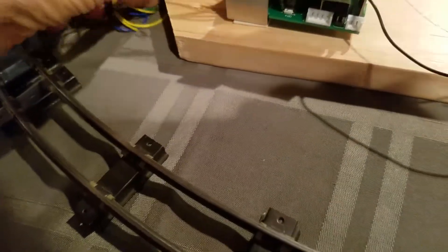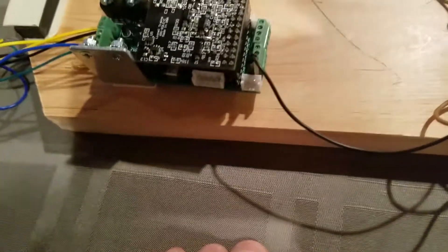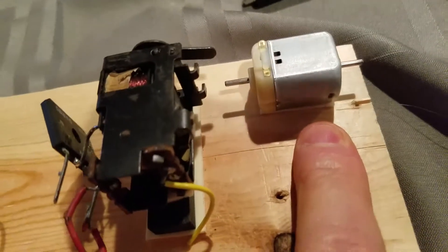Most of the wiring here just goes to the motor. Something was there — I don't know what, it's missing now — it would go to the motor and to the track, that's how you get track power to this unit. So this is track and motor, then antenna, then the accessories. This is one of the higher-end electric railroad controllers, and that's how that works. So these are your options if you're tired of AC or want a little smoother, more reliable operation. This can motor for thirty-five dollars comes with an adapter plate and bolts right on.